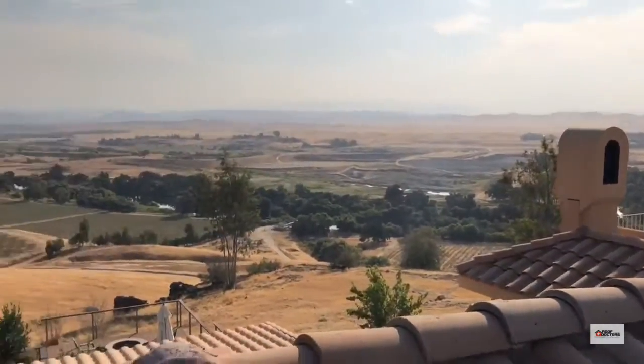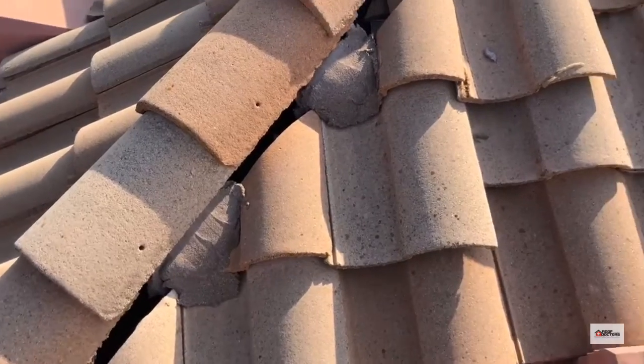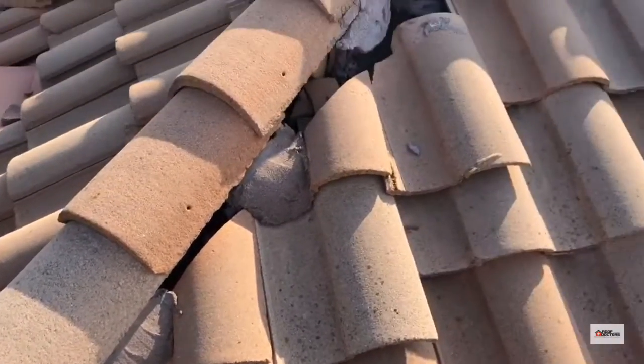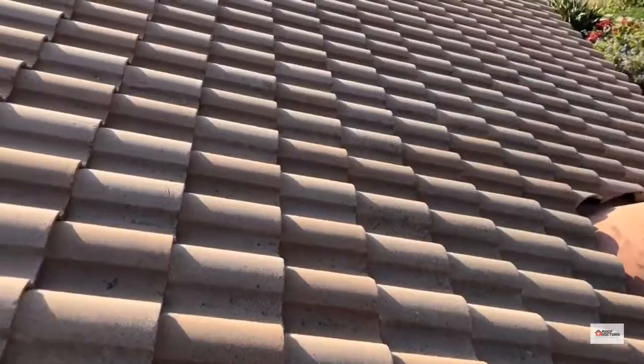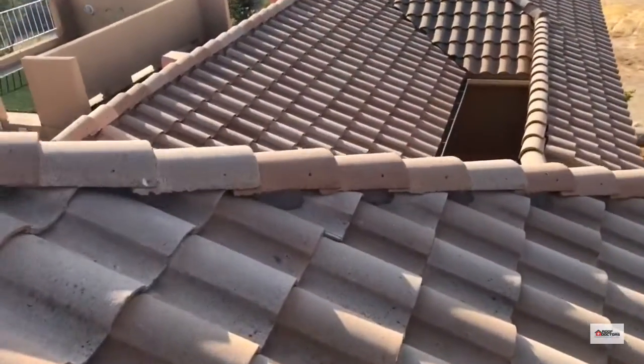I'm on a very large roof out here in Madeira, Far East Madeira. You can see that they didn't do a very good job on these tiles that were cut near the hip — they're all sliding out of place. You probably should glue them to the tiles next to them before they mortar them in. You're kind of seeing that happening in a lot of areas along the hips.